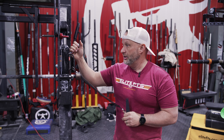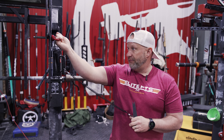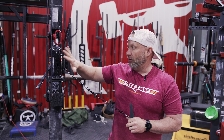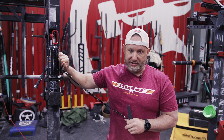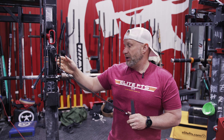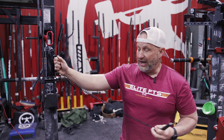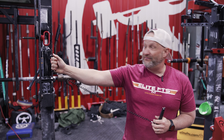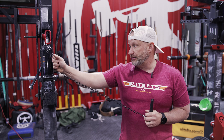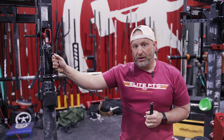You don't want to beat it like it owes you money. Make sure you release the pressure and get the weight of the jack to rest on this cotter pin. It'll help the life of your jack — you won't be blowing them every six weeks, calling me all upset because your jack blew. I've been here for 12 years and I think we've only exchanged one or two of these things in 12 years, so there's definitely something going on out there. Take it easy on the jack, release the pressure, get the weight sitting on that cotter pin.